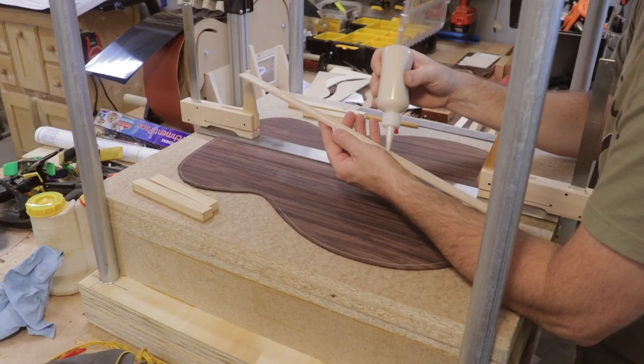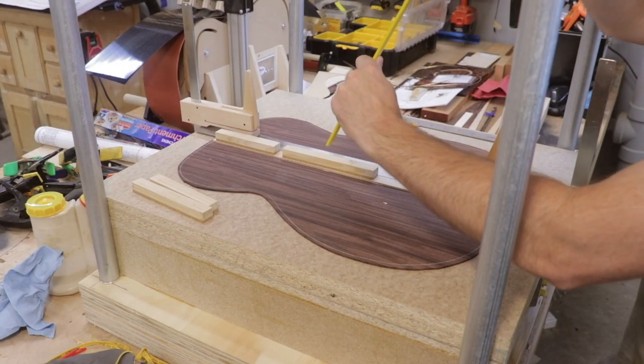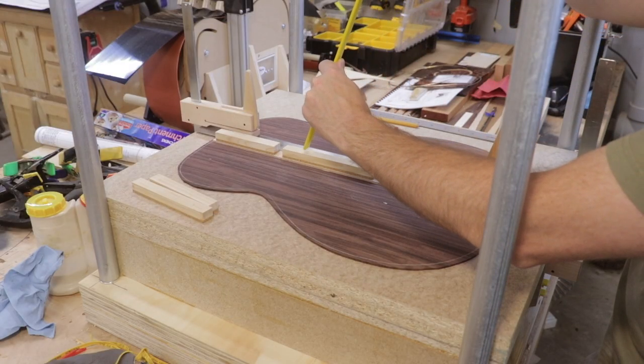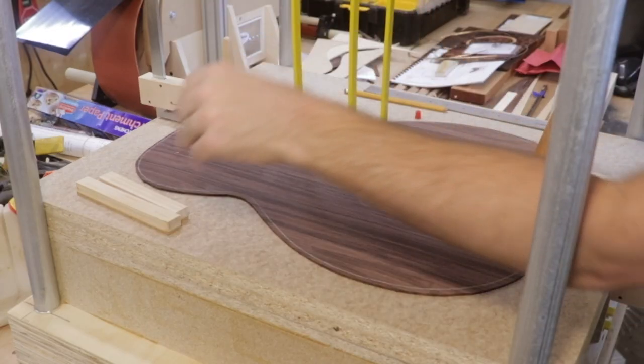The go-bar deck is a jig for using flexible fiberglass rods or sometimes wooden sticks for clamping pressure. The jig is simply made from pieces of plywood or particle board separated by threaded rods and pipes.